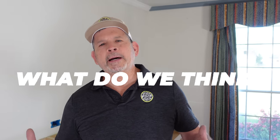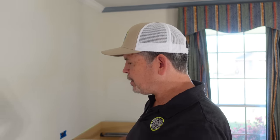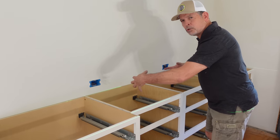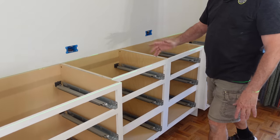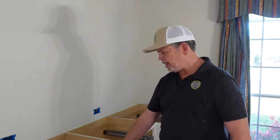So what do we think about the easy level system and is it worth it? So let's talk time. How much time did this take us? Or on the flip side, how much time did we save by using easy level? It took Jordan and I about 10 minutes to put these on the floor and screw them together as one complete unit. It took us about another 10 minutes to put the 5 sets of easy levelers on the bottom. Once we had it flipped up, in less than 5 minutes, guys, we were dialed into our laser beam. My anxiety level, you know what? I didn't even have any anxiety. I was having fun. When's the last time you had fun installing cabinets?